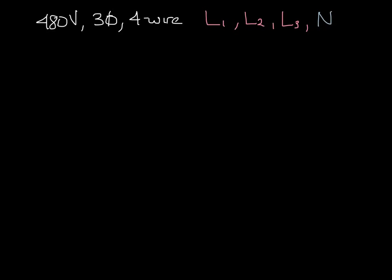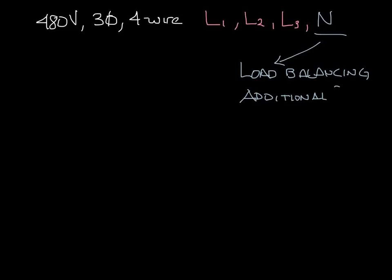But occasionally the neutral wire is not available or it's not pulled to the terminal units. These are usually older neighborhoods or rural areas. The neutral wire is used to handle load imbalances. You want to balance your load across all 3 phases of the 3-phase power. The neutral wire is also an unbroken ground path to the circuit breaker panel, so it provides an additional degree of safety.